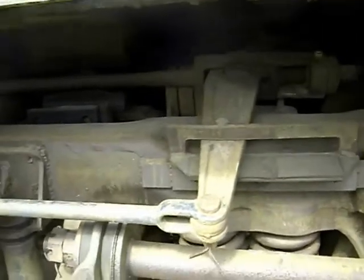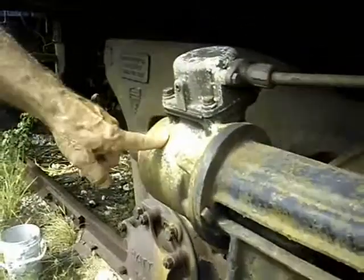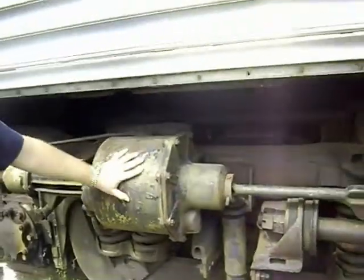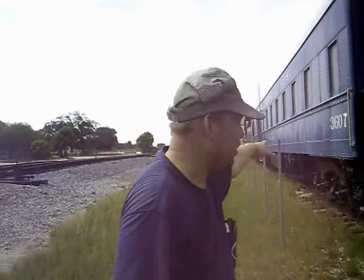But now, what's this big switch coming from over here? This is actually the braking for the train car, where the heavyweight has a single brake cylinder underneath. This has a brake cylinder on each truck. So this is akin to what you'd see on today's diesel locomotives, where you have the brake cylinder on the exterior of the locomotive truck, with all the linkages going to the inside. Where the heavyweight car, all the linkages are underneath the car and they're hard to get to. This is a lot easier to maintain. Right.